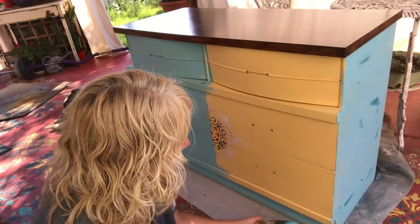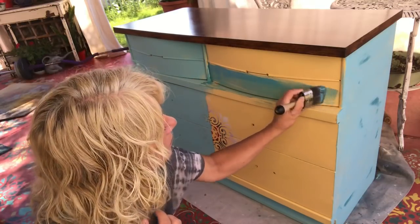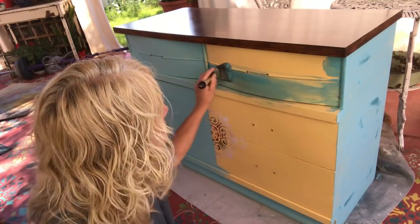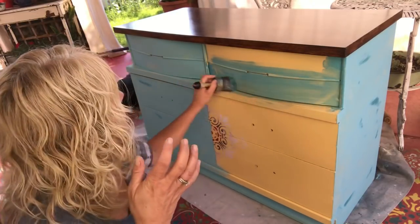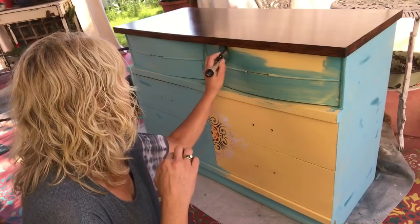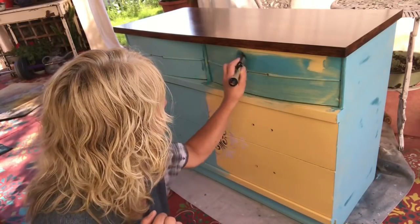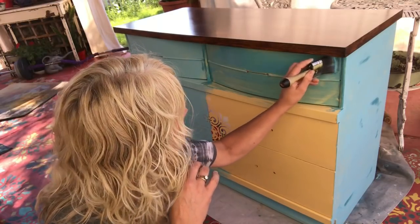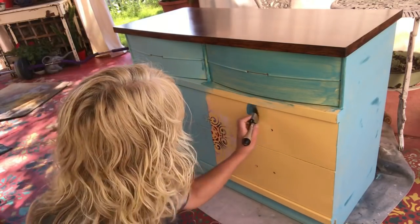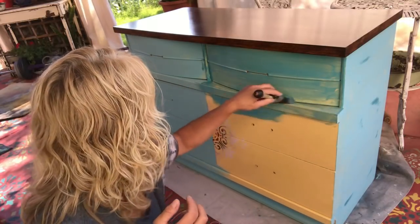As always with blending, we're gonna leave the drawers in. I need to touch up the tops or the sides when I'm finished — I will pull them out and do that. Sometimes I'm going to add paint to make it more solid, sometimes I'm just going to get a wet rag and wipe off what got on there and just leave the edges clean. Sometimes you get drawers that are really tight and when you paint the sides they tend to stick, so it's almost better to leave those natural so your customer doesn't have trouble with the drawers sticking.